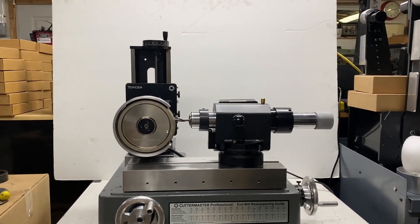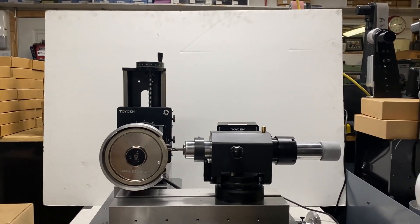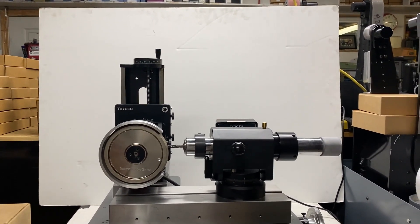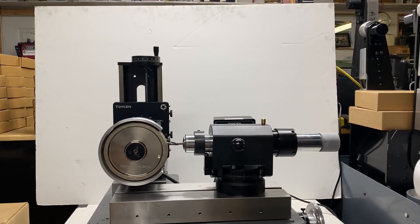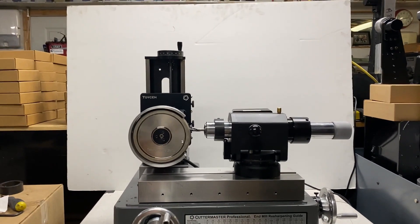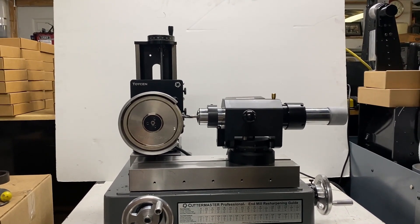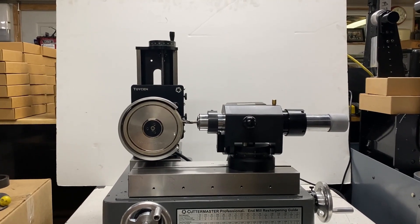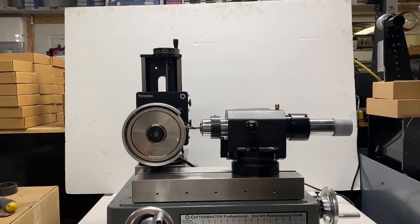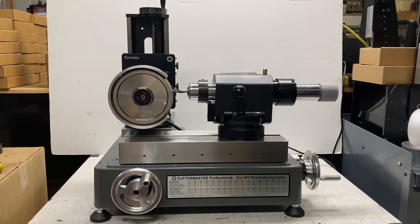The benefit of having the Journeyman JXT with the tower is that you can raise and lower the motor. This is a pretty nice setup because in this particular case the relationship between the wheel height and the tool height is kind of important. You can adjust the heel clearance on the drill — that's the clearance behind the cutting lip. It should produce clearance even if you're down on center, but we were trying for a little more aggressive grind to start with and then we can adjust it once we get set up.